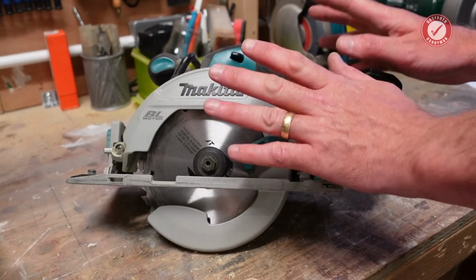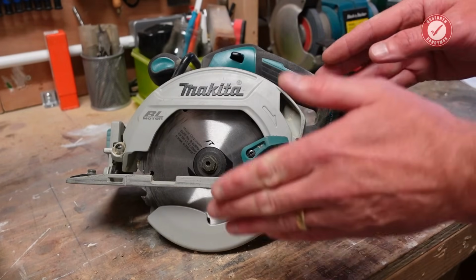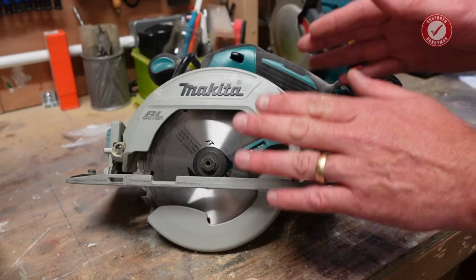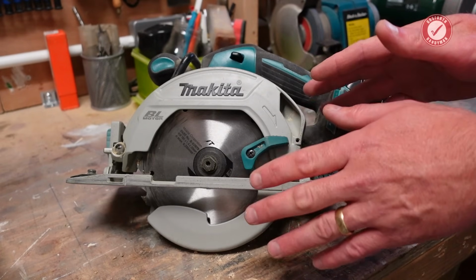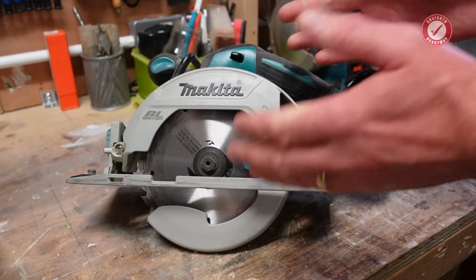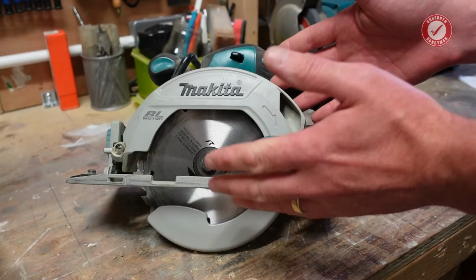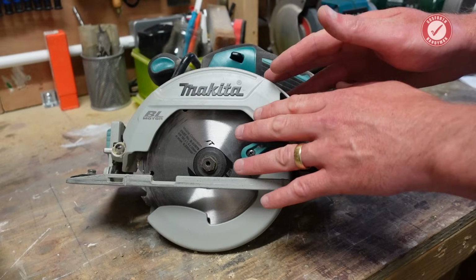Another option is a bog standard circular saw using a straight edge clamped to the door. Again, try to use a blade with a high tooth count on it just to get a nice clean cut, and you can always do multiple passes at different depths. As per usual, just try to do test cuts if you can until you're used to how the saw and the blade's going to perform.